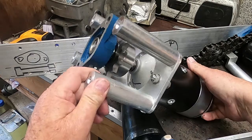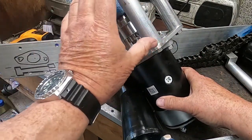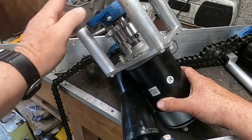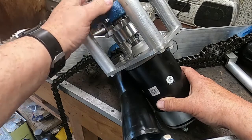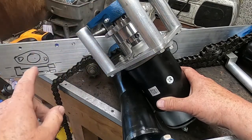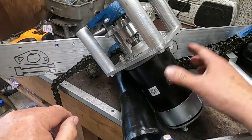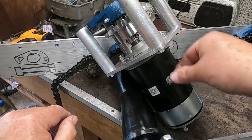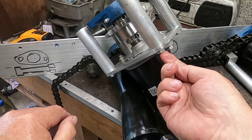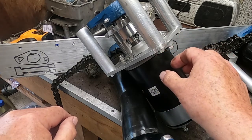Well, as you can see, I've been busy. I've got four of these legs. They're all machined to the same length, to within a thou, and they're going to bolt onto this, and then this shaft will be supported with this bearing. This is just a dummy run at this stage, but eventually I'm going to continue these shafts from here across, and I'll just use a piece of studding, which I'll Loctite into this tube.